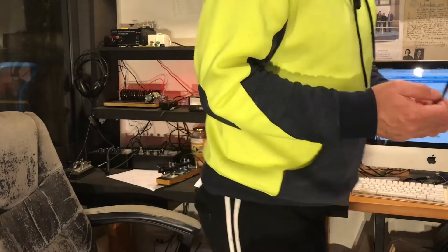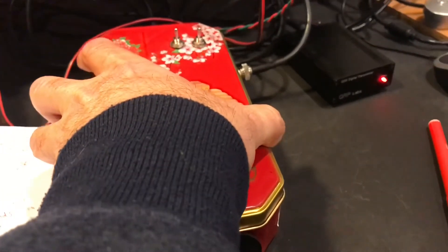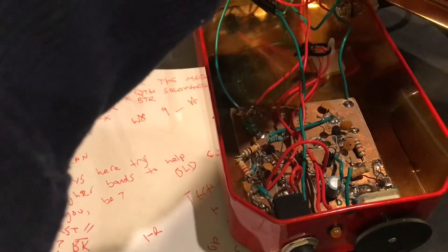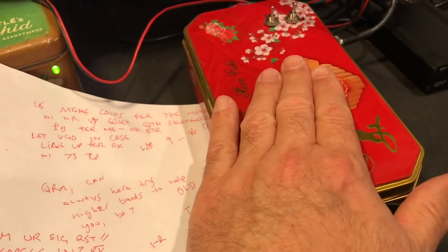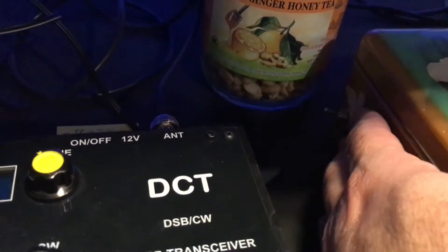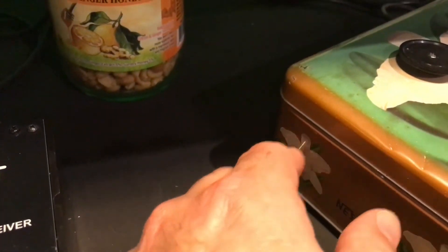So much to learn on the roll-your-own front. I'll take the phone down and show you some of the stuff that's in here so you can get an idea of how the station has evolved. First, we built this little two-transistor transmitter - very rudimentary. I've left plenty of room in here because I'm going to put a five watt final stage in it, so you'll be seeing that shortly. It's a variation of the Pixie transceiver, just the transmitting section. Then I also started playing around with this chocolate box receiver, which you heard a little bit of SSB from at the beginning of this video.